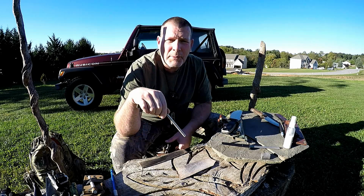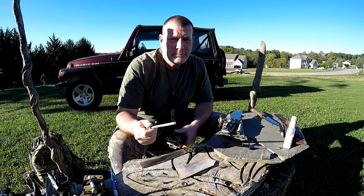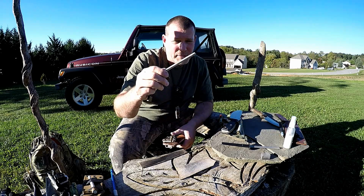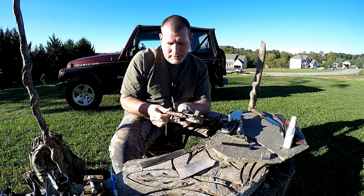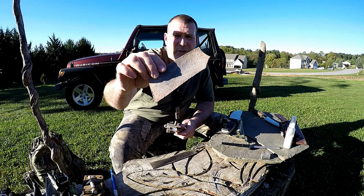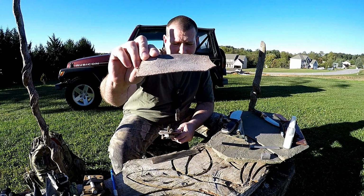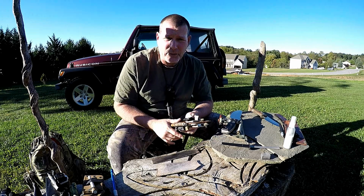And then you use a strop. Real simple. I have a real simple philosophy for the field. I use what works and works well. Okay? And it's not a difficult system. There's three components. A diamond rod, generally. Now sometimes it changes a little bit. But generally a diamond rod off of my system. Okay? If I need it. A lot of times I don't need the diamond rod. I just need the strops. A strop. Okay? Usually carry two of them. Just pieces of leather with compound, okay? This one has black compound on it. This one has 1 micron hand American diamond spray on it, okay? Which, phenomenal stuff, okay? I won't use anything else as far as diamond sprays are concerned.